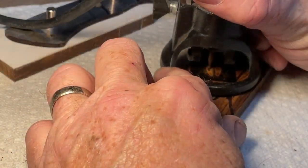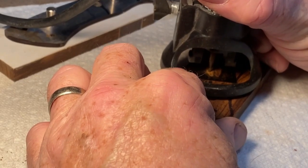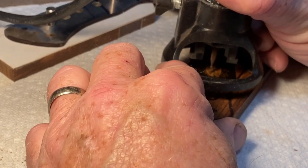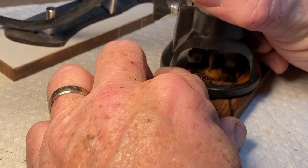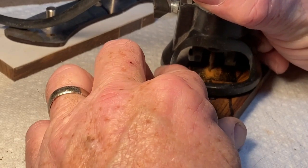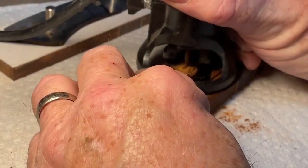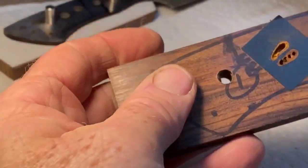I'm not going to show you how to segment them — it's a pretty straightforward process. But what's different here is I've taken a cutout from that craft vinyl cutting machine of elk hoof prints. I put that silhouette right onto the wood and I'm going to use a Dremel grinder with a very small routing bit and a router attachment to slowly start to cut away everything on the inside of that stencil. It's a self-adhesive vinyl stencil of the hoof prints.